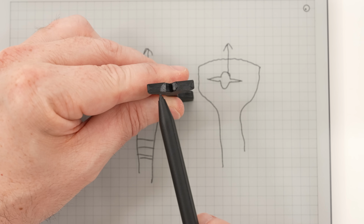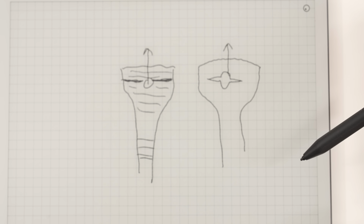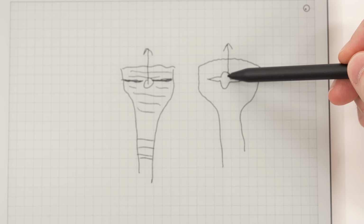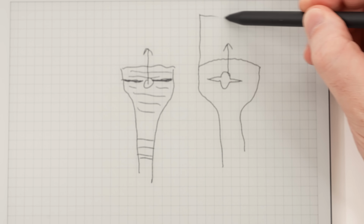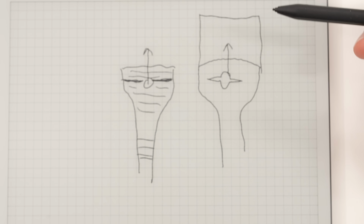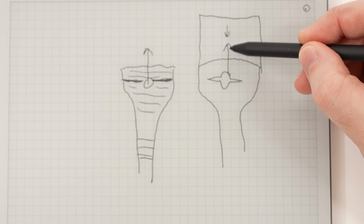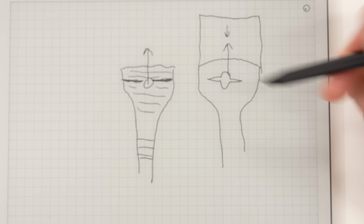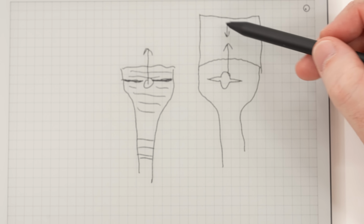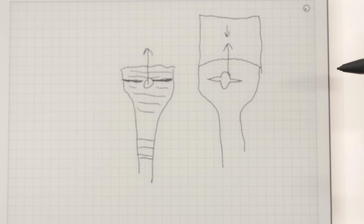But the failure was happening right in the center, and it's happening because of the flexibility of the material. Now, if I built a whole bunch of material up on top here to back that up, would that have made it better? It probably would have made it a little bit better, but this material in here would get compressed and you'd have that same situation. And so I don't really think adding more material on the top or adding more material on the sides here was ever going to help.